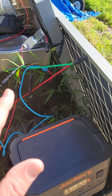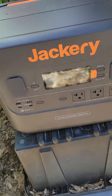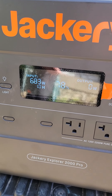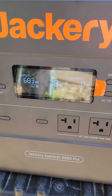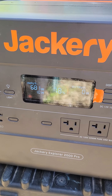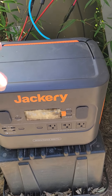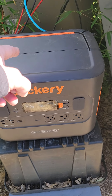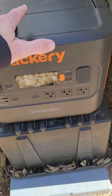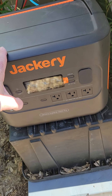I'm actually using this for something else on my house, but I love this Jackery Pro so much. Right now I'm getting 683 watts. Each input is probably at about 38 volts, so there's about 76 volts going into this thing right now per each side. You're limited at about 1000 watts doing it that way, even though it's supposed to be 1200 watts.